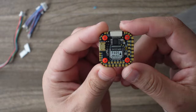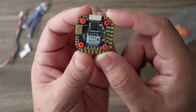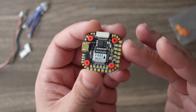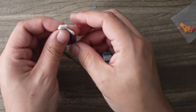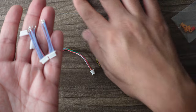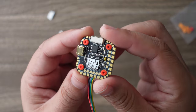Let me use this Skystars board to illustrate some of these features. One thing I like about this flight controller is that all of the pads are labeled — there's a silkscreen so you can see the pads at a glance without having to look up a pad layout diagram. These have flat-style pads and they're a fairly decent size for a 20x20. It also comes with a series of cables. You can take the empty connectors they provide and create your own ESC plug in the order your ESC requires. It also comes with a DJI plug-and-play cable for both your ESC and HD system.